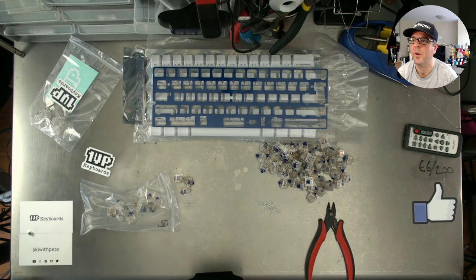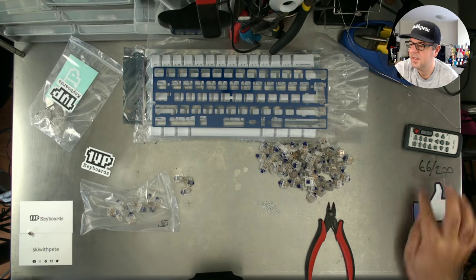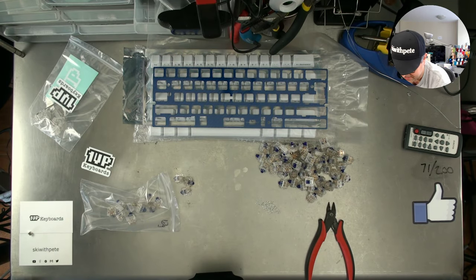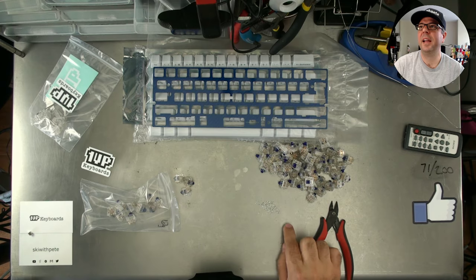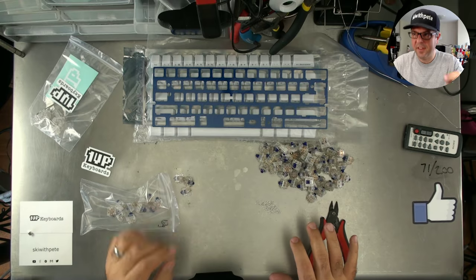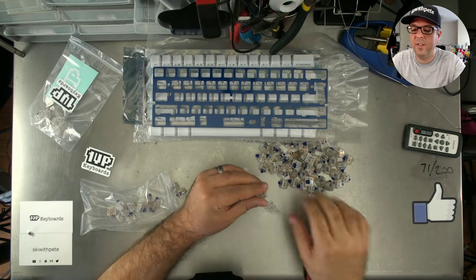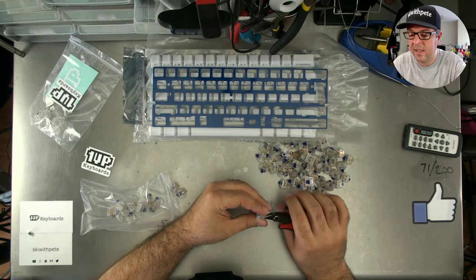Atari Zero says, what software do you use to program your Gone Nerd TKLs? Atari, I use the Nerdy GUI, which is available from Gone's website. We should probably link to that on our website. We'll do that later today, but go to Gone's website. It's called Nerdy GUI. It's for Windows only, and that's what I use. I spend most of my life in Linux and Mac, but when I want to program my Gone Nerd, that's what I do. Also, it's onboard programmable, so if you watch the video on how to do it, you tap, then program in what you want to program, and then you lock it in. If there are any errors, you can go in and fix them in Nerdy GUI. You could also rewrite the software if you wanted to using TMK or QMK, which is also fine, but once you've overwritten the software, you can't go back.